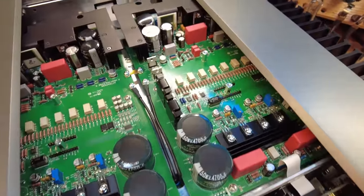The other thing worth noting is the voltage ratings on some of these capacitors. I see 450 volts here — unusual for an amplifier. 250 volts on these, and some at 400 volts, and here 450 volts on those. I imagine that's part of the high-voltage topology they're talking about.